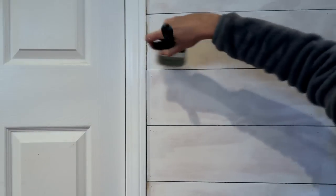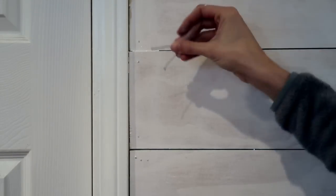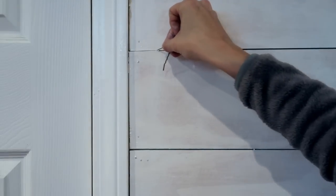Sometimes the brush is a little hard to get on the edges, so I'll take a cheap Dollar General brush and just paint by the trim, making sure to get extra paint out of the middle. If you zoom in you can see there's paint in the cracks — take a bobby pin, bend it, use the skinny edge with no ridges, and scoot it in there to get rid of it. It took me almost four hours off and on to paint all the primer in the room, and it is looking amazing.